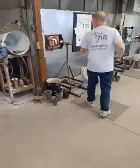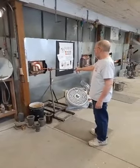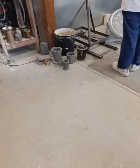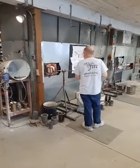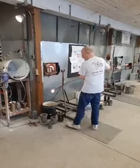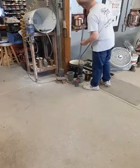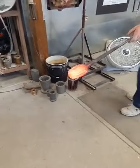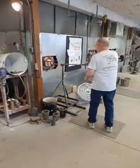Foster has now inflated the glass a little more, and he's going to work on getting the size and shape like he wants, and then he'll drop it into the optic mold. Those aluminum canisters are shaped with ridges in them, and that's how we impart the shapes to the pieces. If he gets this really hot, it'll just kind of drip right in. Then he'll blow with pressurized air pushing out against the piece, and that gives us our design element — since it's just an optical effect, that's why we call it an optic mold.